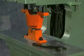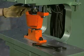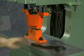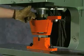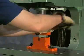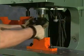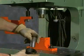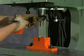This is the punch station, which utilizes four main components for standard punching: the punch holder, the material stripper assembly, the die block, and the coupling wrench. The punch holder includes the punch stem and coupling nut — the punch stem bolts to the ram and the coupling nut threads onto the punch stem. For punch installation on dual operator models, loosen the stripper stud nut and rotate the stripper assembly out of the way. Using the coupling wrench, remove the coupling nut, place the punch in the coupling nut tip down, and reinstall onto the punch stem. Use the coupling wrench to tighten the coupling nut.